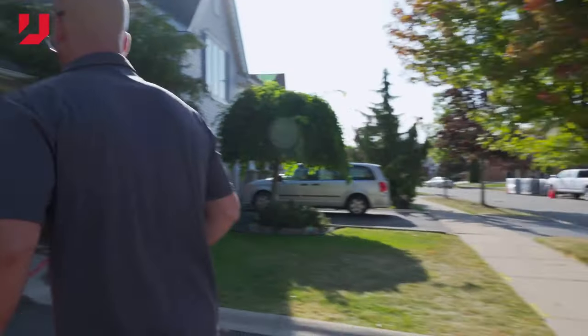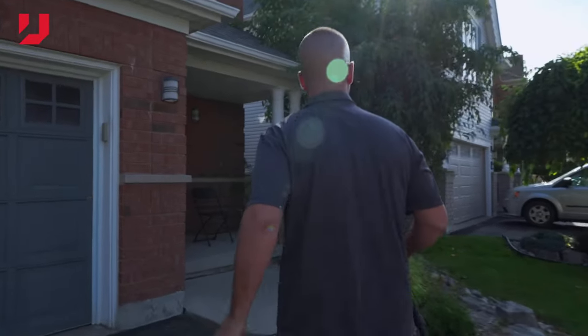As you move the story pole around the job site, if the ground goes down, your story pole gets longer, which is very confusing. If you want to add 3.5 inches depth over a certain grade, you've got to do that either in your head or on a piece of paper. It's fairly complicated, actually. And you don't have to do that with the U-Level?